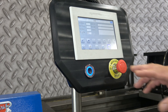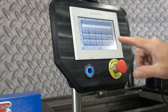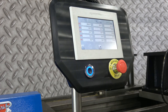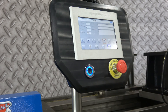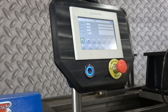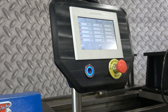Changing the program is very simple. If you want to modify the bend angle, simply select the box where you have your bend angle and change it — to 100 degrees, for example. Select okay, go back, then click on the disk to save it, because you want to save it otherwise nothing's going to really happen. Select the check box and that cements what you did. Then go back and look — the information is saved in the program.